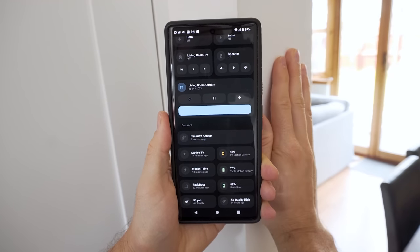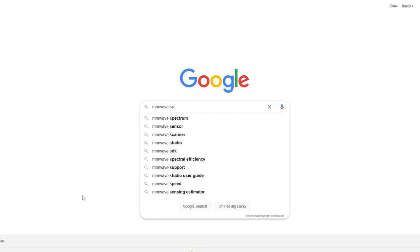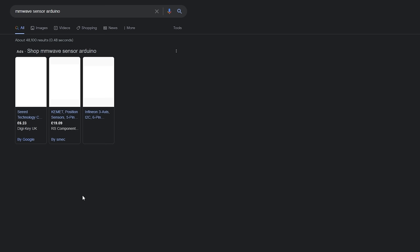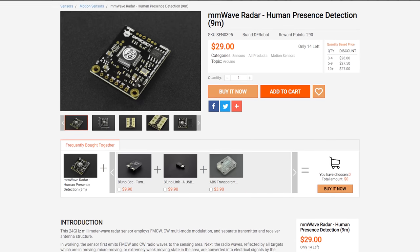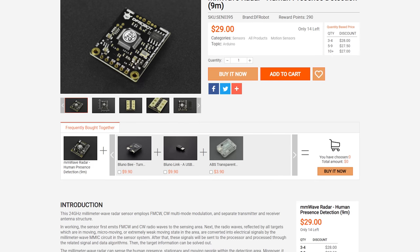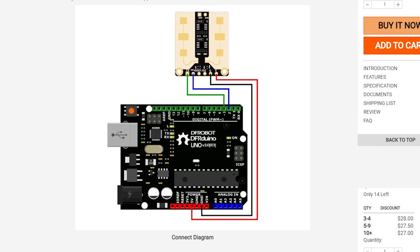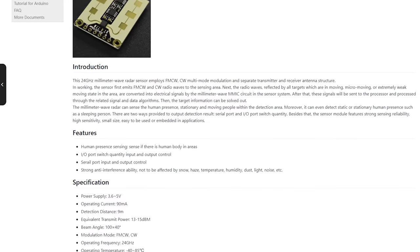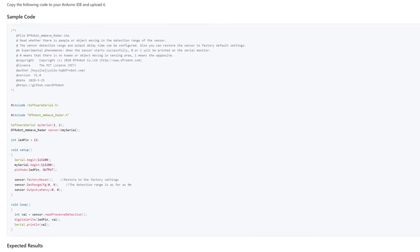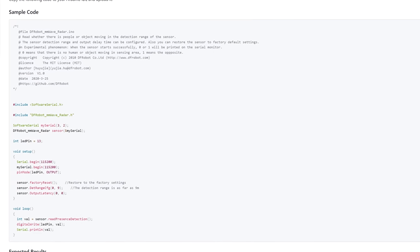Yes, and it's really good. I started researching millimetre wave DIY sensors, and after a quick Google search, I came across this millimetre wave sensor from DFRobot, which works on the 24 GHz spectrum, has a quoted range of 9 metres — which is 4 metres more than the Aqara FP1 — and had a nice simple connection diagram for Arduino. Most importantly, it had a rather detailed wiki page including some sample code, and at less than £30 for one sensor, it was certainly worth a go.